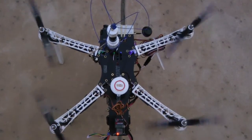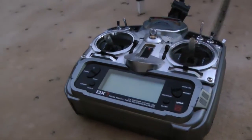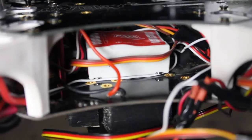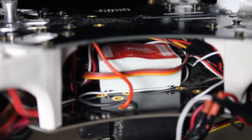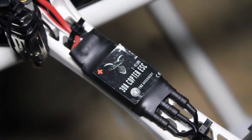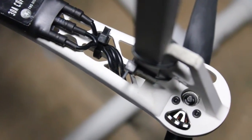I am able to control the drone using a 2.4GHz remote control transmitter. The onboard 2.4GHz receiver intercepts my transmitted signals and sends each input to the flight computer. The flight computer properly reads and translates the inputs into a coordinated set of commands for each motor. These data commands are passed to the proper electronic speed controllers, or ESCs, which are attached to a corresponding motor.